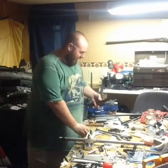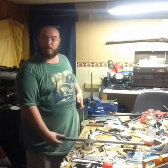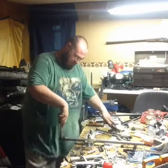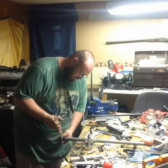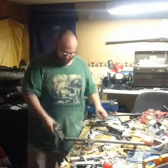So what you're going to do with that is you got to have your bolt in. You go ahead and slide your barrel nut up on it and your wrench. Your wrench needs to be on there to begin with. Don't make the mistake and have to pull it out. And on a new barrel nut, you got to kind of work it. And I like to screw my barrel nut all the way forward.